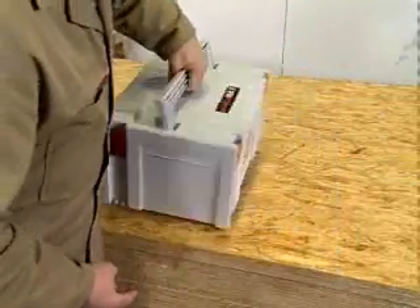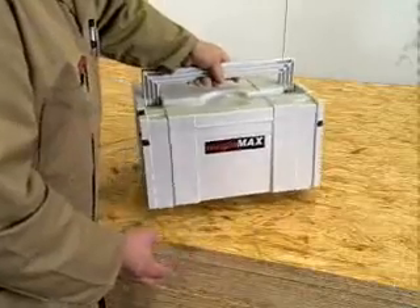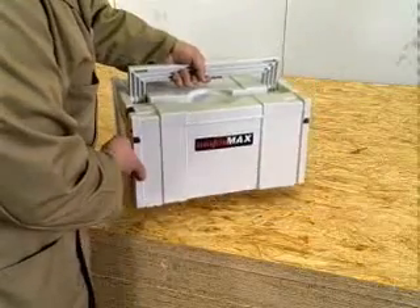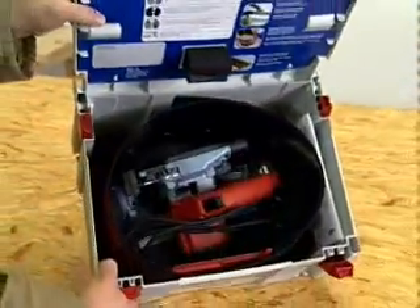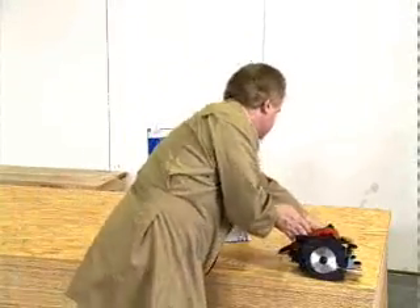This case contains an all-in-one machine: a 900-watt portable circular saw with a shadow gap saw and a plunge cut saw, as well as a guide rail with an effective length of 1,400 millimetres. The entire machine weighs just 2.3 kilograms. What you see here is an all-purpose work case for professional use, setting the standard in portable deployment and maximum on-site flexibility.